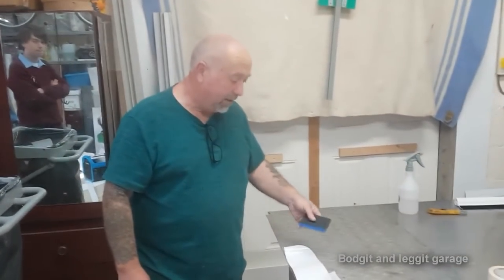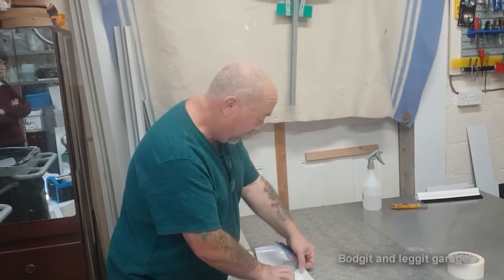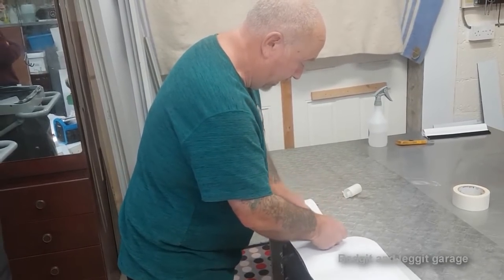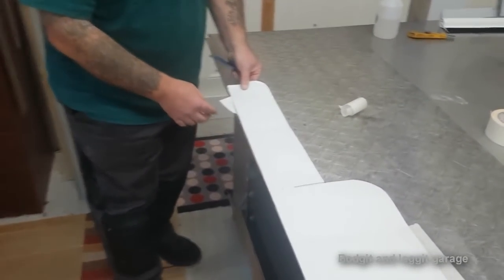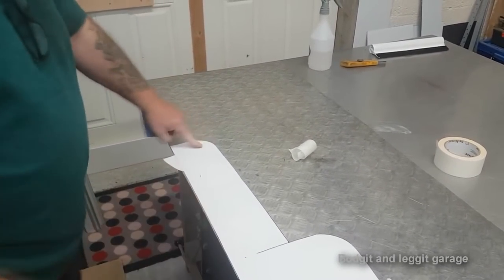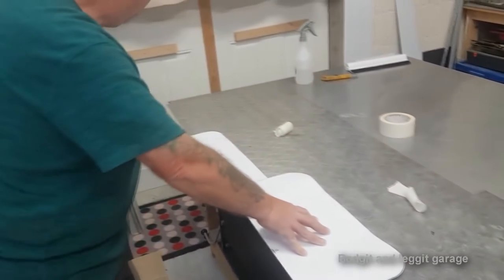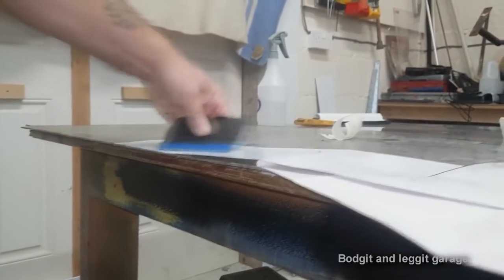All I'm going to do is simply apply this by hand. I'm just using tape to act as a couple of extra hands. If this was steel, I could just use some magnets. I'm going to peel the corner back and I tend to use a little angle there just to make life easier. We're working off this edge, which is almost straight, so I'm just going to pull that down to this side. I got this for free, that's why it's all kind of misshapen, but it'll do fine. I'm just using a squeegee. Now that's stuck down with the tape, I can remove some of these. By pulling that, the curve on this paper keeps this from sticking down, so it allows me to bring that in with the squeegee.